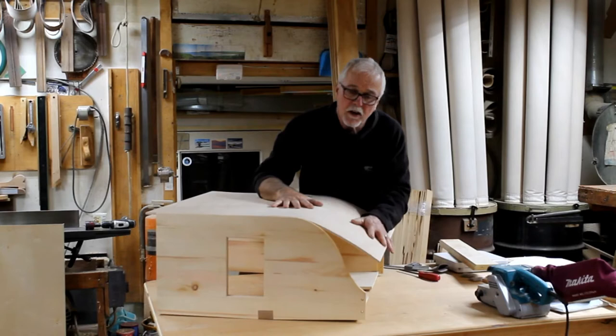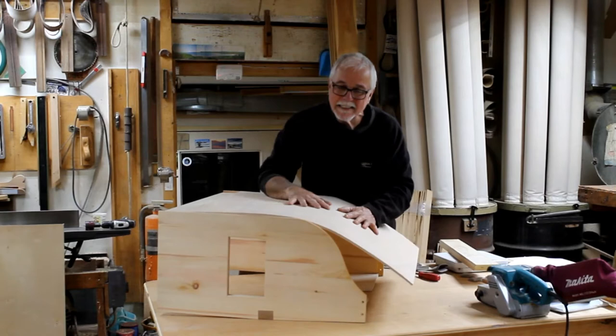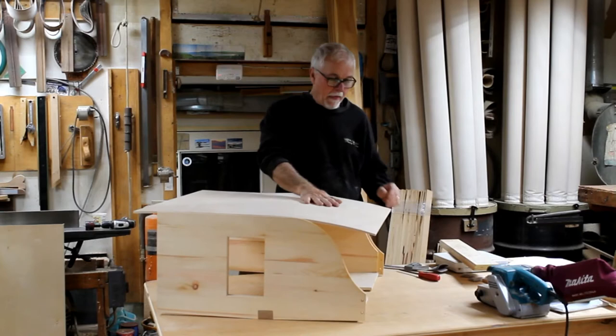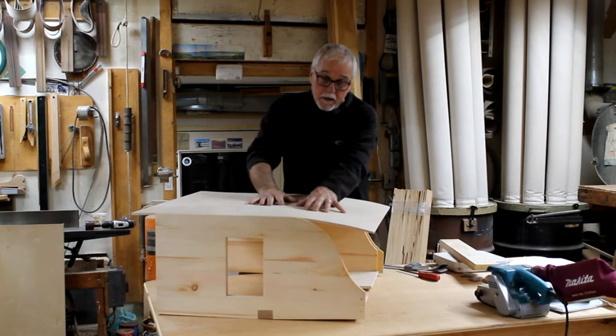Now, as you bend it around, you can hear all kinds of cracking. And it freaks you out a little bit when you hear that. But it's designed to do that. For the most part, this stuff is designed to have a finished veneer over top of it. Because we're painting this engine cowl black, we'll bend this around. Yeah, it'll crack along the grain and open up.